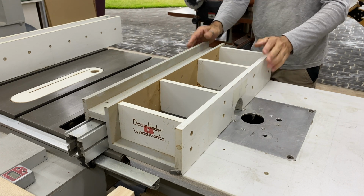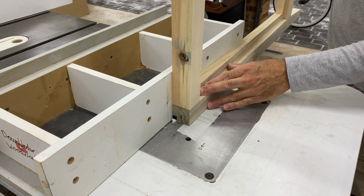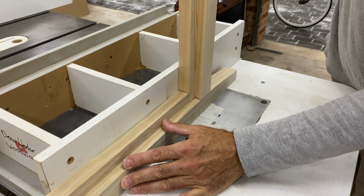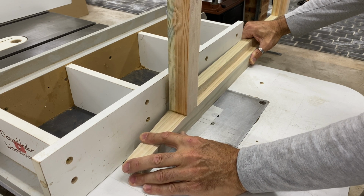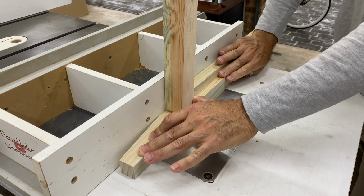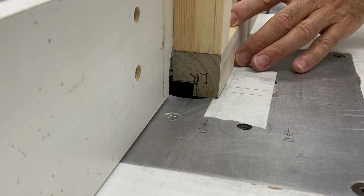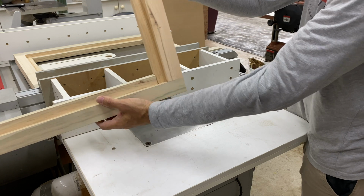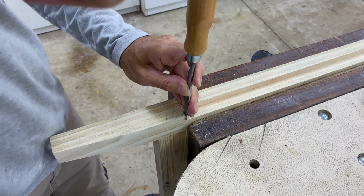The back panel for the dresser was 12mm MDF because that's what I had, so I cut a rebate in the back of the two side panels using the router table and a 1/2 inch spiral bit. This was a stopped rebate at the lower rail, so again I used pencil lines on the router table to mark where my bit was. I then squared up the round corners with the chisel.